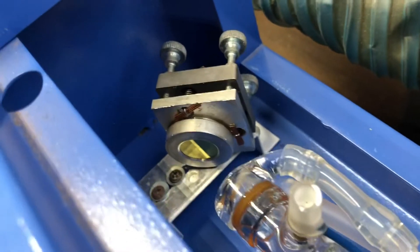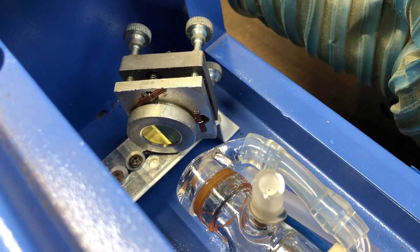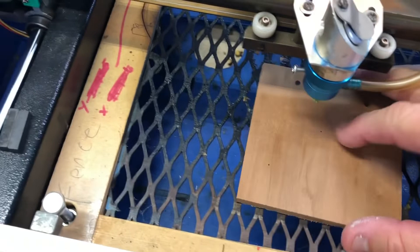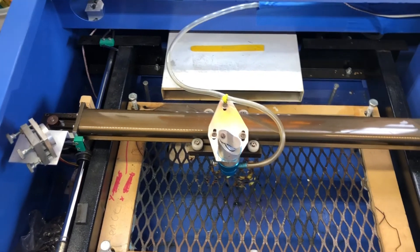Got the first one in, it's pretty. Got all three in. I'll do a test fire here — I'm going to shoot it right here, and you can see in the center there are no dots there, none right where that line is. Boom — totally different amount of power. On the back side it came out right there, so we're back up and running. I shot some samples — right there, a little dot, that's where it came out. That was the fix — just needed to replace the mirrors. If you're shooting double dots, get some new mirrors. Have a great day.